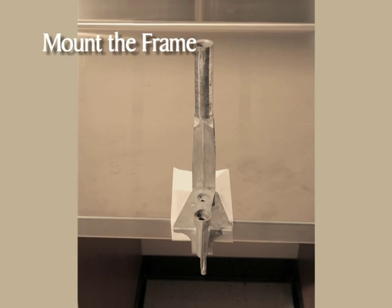With the parts identified, we can begin assembling the can sealer. First, situate the frame by clamping it securely to a table. Use a cloth or a piece of cardboard to protect the table surface. Slip the three-inch pin into the hole in the clamp screw and tighten until it is secure on the table.